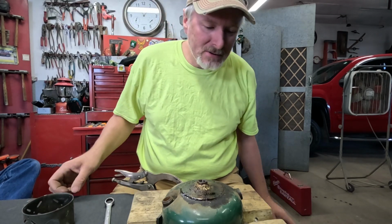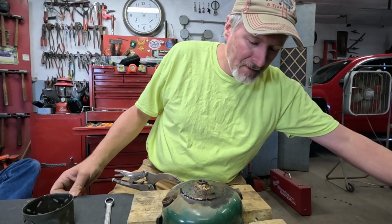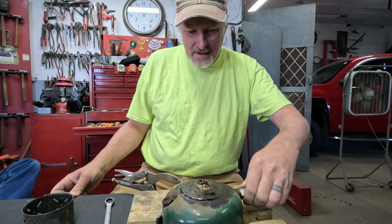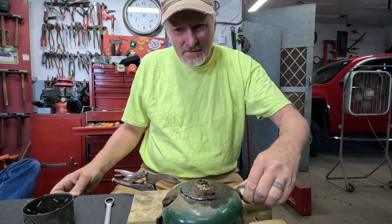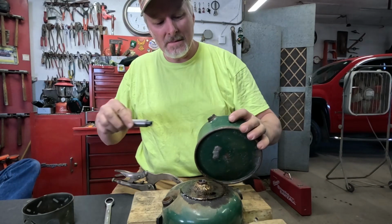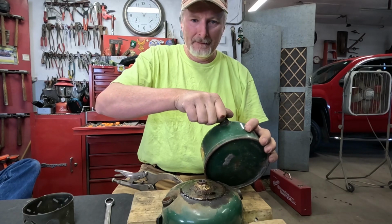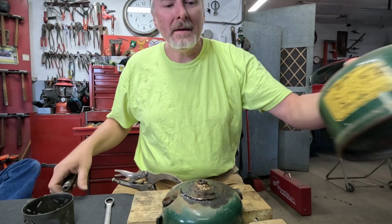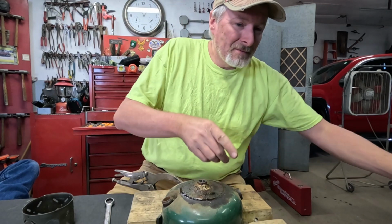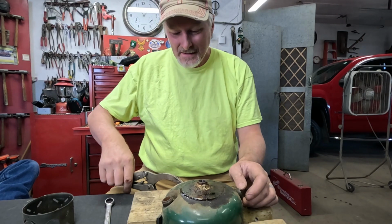But I do know we got two lanterns that are pretty well tore apart. I don't know if this one has the correct size. No, check valve tool dropped in on that one. That's weird. You'd think that they would both have the same check valve in it. But I do also know that that check valve is already leaking, so if the one that's in there works, I don't see any reason to take this one out to try to change it.